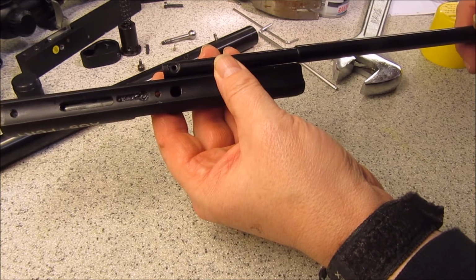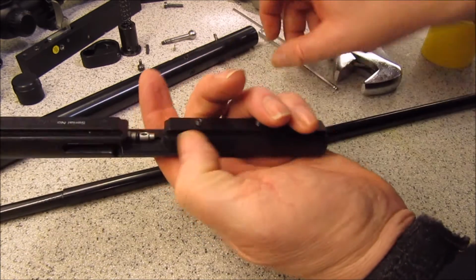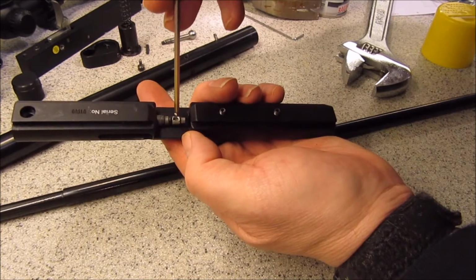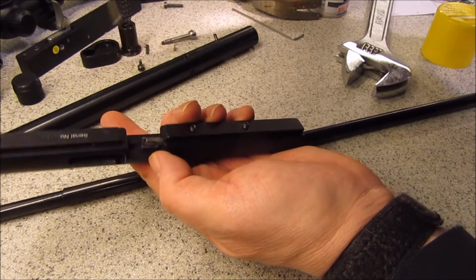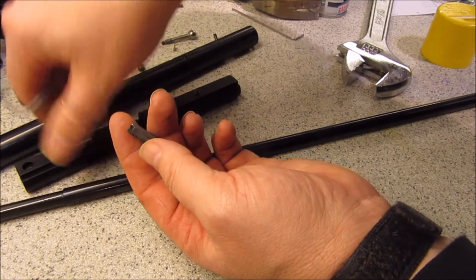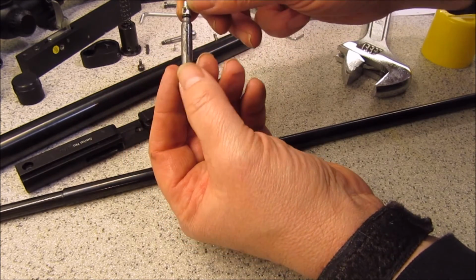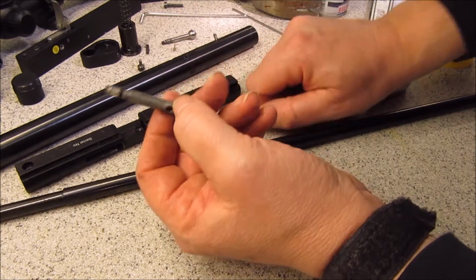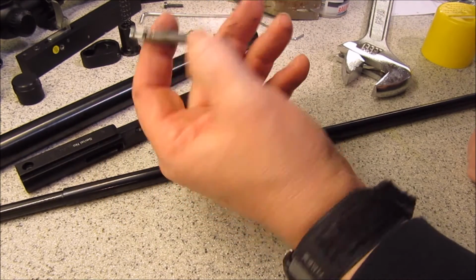And that's where it fits within the breech block. So hopefully now this pellet probe will be able to come out, and it does look. It's unusual that it's coming out through the front rather than the back. So I'll be replacing the pellet probe O-ring there, because what I did notice the other day, it was squirting air at me, and that's probably where it's coming from.